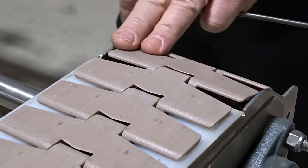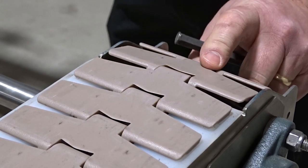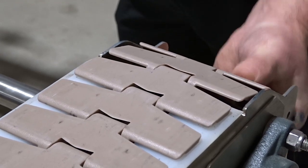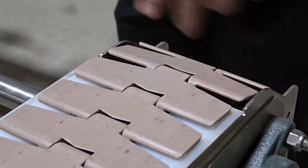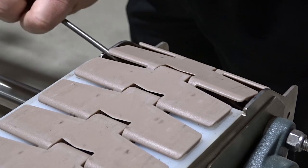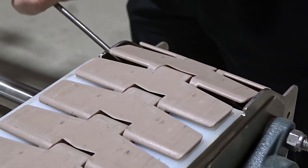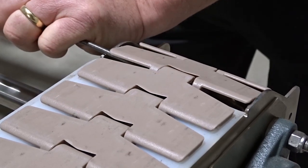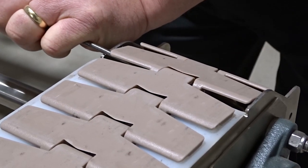What we're going to show here is how to remove the pin on the chain when it's on the conveyor. We like to do it on the idle end as it gets a little more looseness and a little more area to work than dealing with the motor. So you want to slide the drift pin under the chain, find the pin of the chain and pound it up.